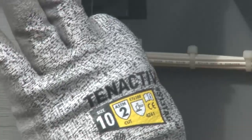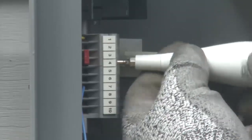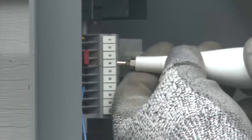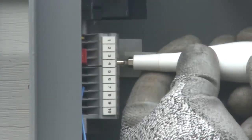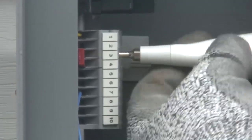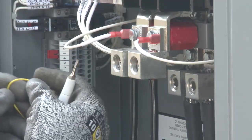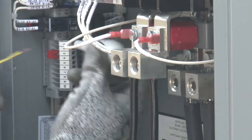The DC control wires connect to the automatic transfer switch at terminal block TB4 on the left side of the switch. For these generator set models with the RA112L1 automatic transfer switch, there must be a jumper installed across terminals 3 and 4 of TB4 to provide the correct type of transfer control signal. The three DC control wires that were connected to the generator set are connected in the ATS at TB4.